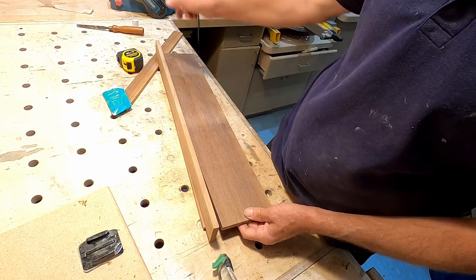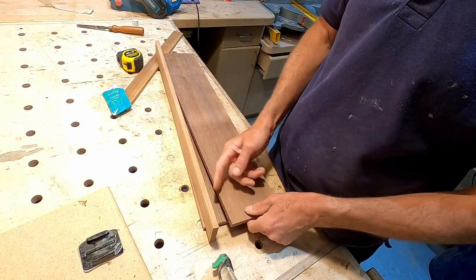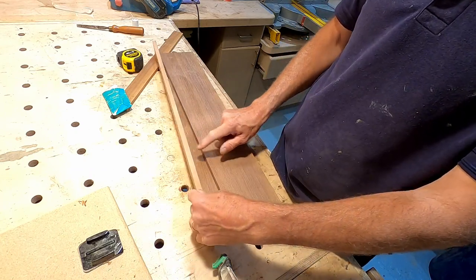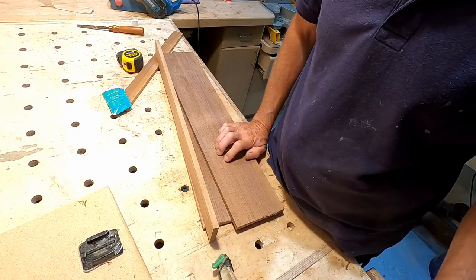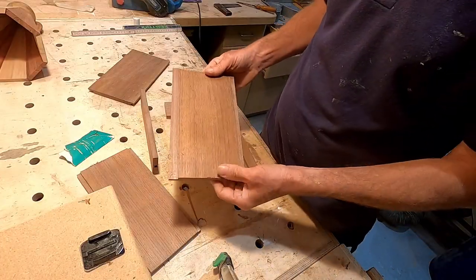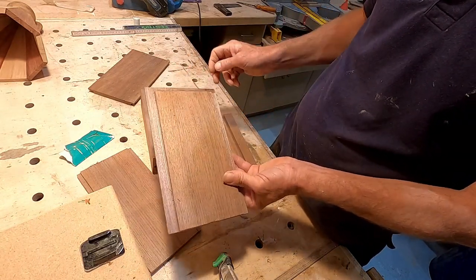If it slid right in underneath, so the end of the speaker's up there, you'd never get your phone back out again. So I'm just going to cut like a little rebate in there to allow this little drawer to slide in and out. I'll cut it all up and show you, it'll be easier. Okay, so this is where we're at now. So I've cut a rebate in the top and the bottom all the way around.